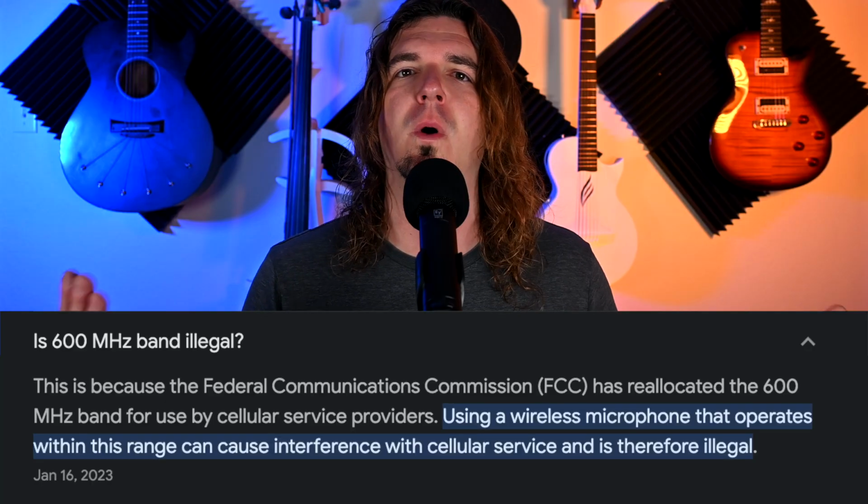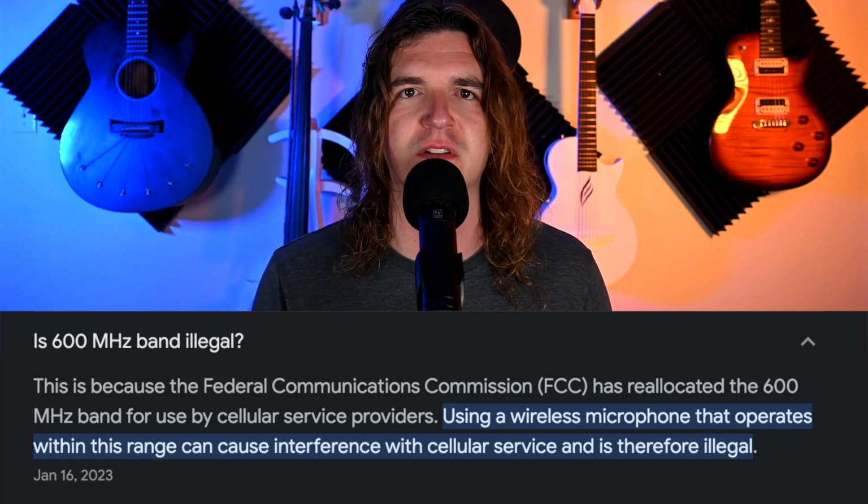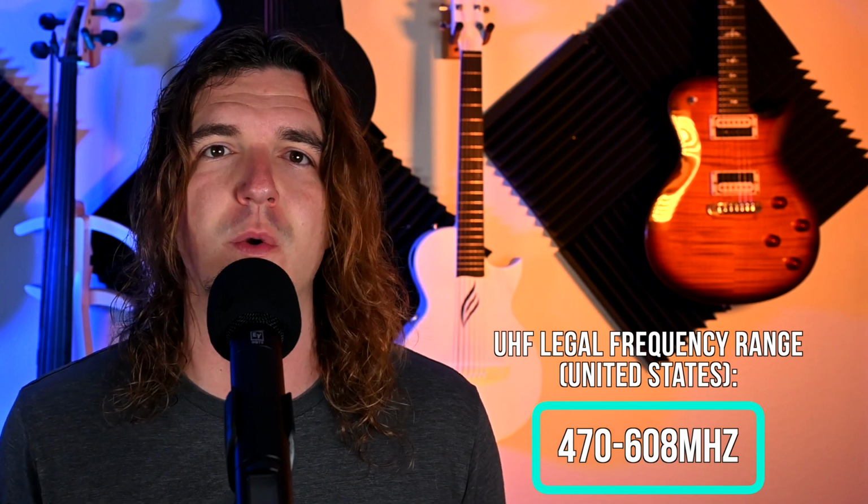And if you're like me, before I found out about this system, you were like, well, I thought that the FCC bought all of those and you are no longer allowed to use anything above 600 megahertz. That's true. A while back, the FCC said you can no longer use wireless microphones above 600, specifically 608. So in the United States, the legal frequency range is from 470 to 608 megahertz for the UHF frequency range.